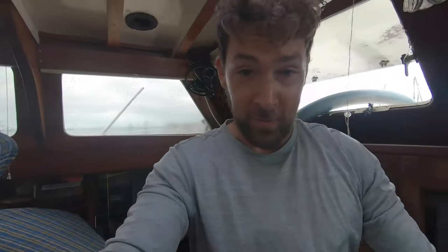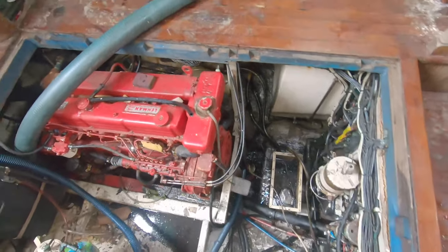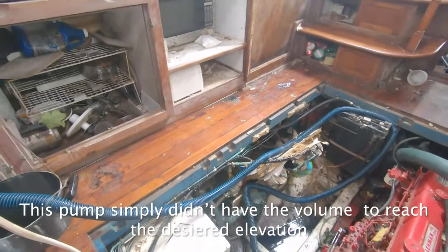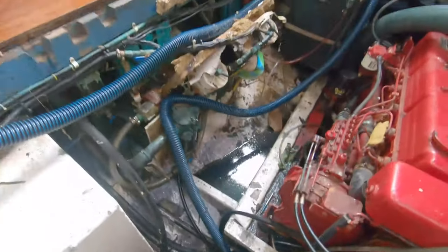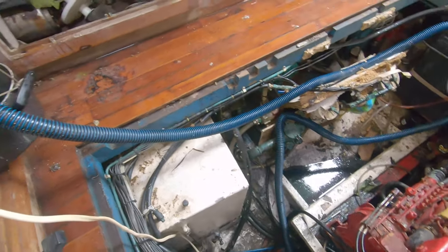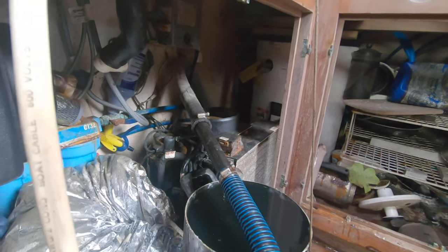This boat was underwater for a while and the bilge pump was pretty cool. I used a high-flow, gas-powered pump yesterday to get the majority of it out. There were some leftovers from the forward and aft bilges, so now I have a standard 900 gallon per hour 12-volt bilge pump. There's some science that says you can't pump water directly uphill. I thought about Dutch dyke systems where they use separate mills to pump water through levees up elevation. The bilge pump is on the bottom, the first pipe runs up and I created a trap — enough pressure to fill a first and second trap. By squeezing the pipe and manually forcing water up through the line, I got it up through the through-hull for the sink, which is gravity fed. So I created a siphoning action with a pump on the other side.